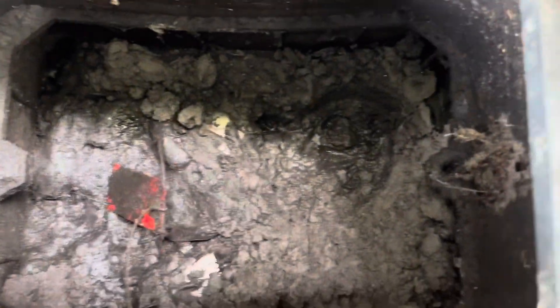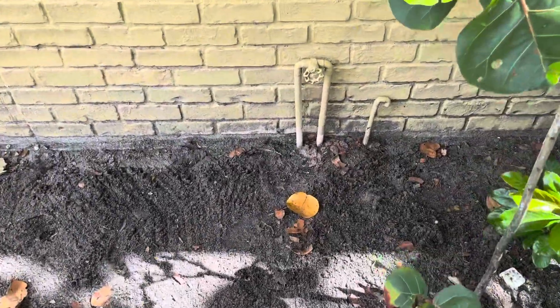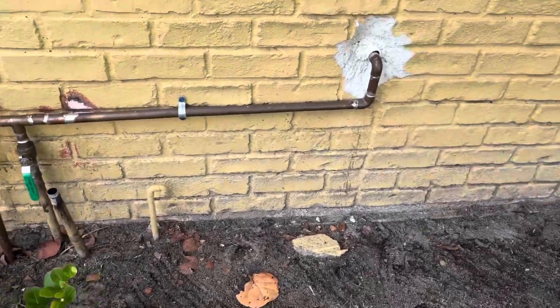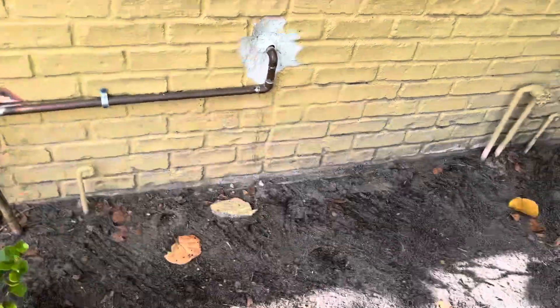Just shut the water off down there at the meter. I'm going to replace all these units — not all of them. This one's sitting at the original. This one's been re-piped. Something happened — I think these got poly B lines. She had a leak last year with them, so I'm going to replace her shut-off valve too.